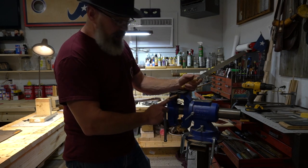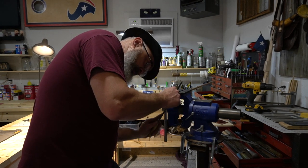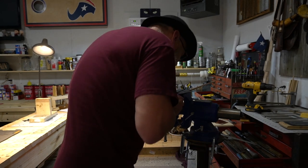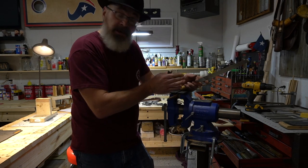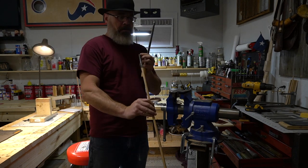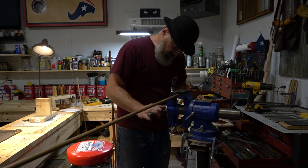We want to get the edge here that we cut out with the chisel fairly straight — see where it's touching and where it's not. Start backing that edge up where it's touching. I can see the edge I cut with the chisel is not perfectly round and not perfectly set. So I'm going around and setting that. I want to look and see if that is bent any particular way. It is, so I'll take this edge and file it down to straighten that tip back up.